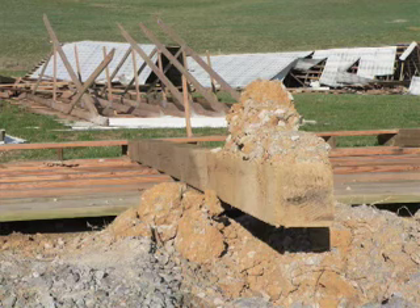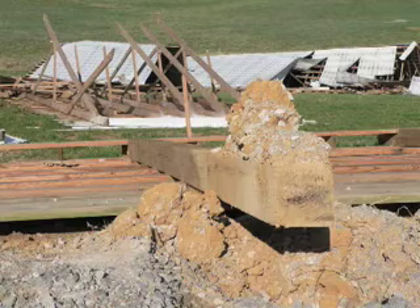One thing that's extremely important when we think about building that barn are the poles used in the construction. We need to be sure that the posts are put down in the ground deep enough so that if we get a strong wind they're not pulled out. Every year we hear of a barn or two where the wind has lifted those out. It may be that they actually need to put some cross rods at the bottom of those posts to give extra structure to holding that pole in place.